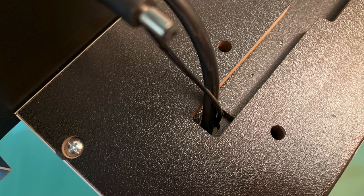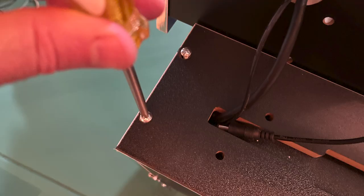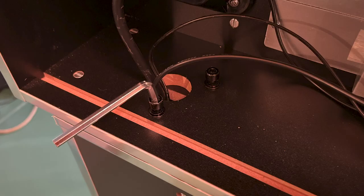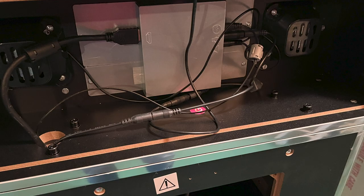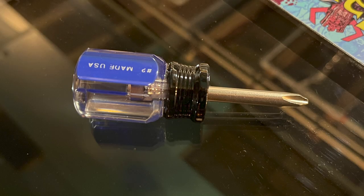To make it work, I had to unplug the display and power cables, then remove the back box and the wood plate it mounts to from the body of the table. I then threaded the power cable through the holes between other cables and replaced the plate and back box. I plugged the power cable into the open end of the two-way splitter and attached the four-way splitter to the opposite end at the front. To work in the tight spaces inside the cabinet, I highly recommend getting a shorty Phillips head screwdriver — I definitely needed it on this project.